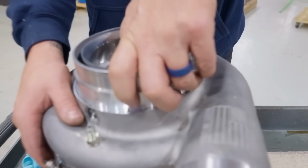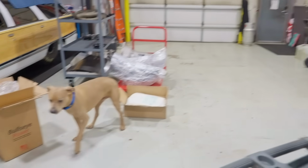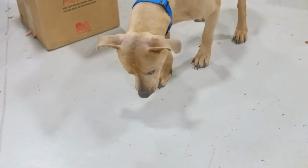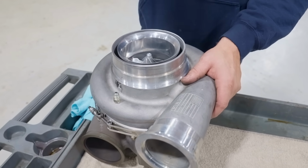Sorry, I'm distracted because I'm actually spinning it. And he says that it's been really good. They see improvement, with hundreds of hours of cycle time through it as they're testing it with OEMs on stock small turbo stuff, and it doesn't hurt the turbo blades because it will just come right off. Now, we'll do this slow and easy: running, idling, getting up to temperature, then two-step stuff, RPM, do a few RPM cycles, make sure to get it hot, so that everything grows and expands to what it would normally be at.